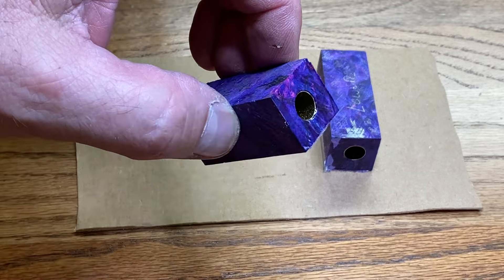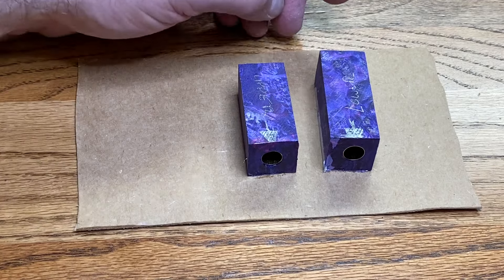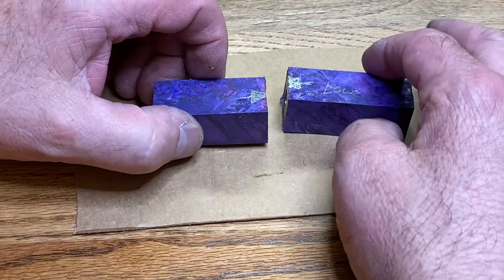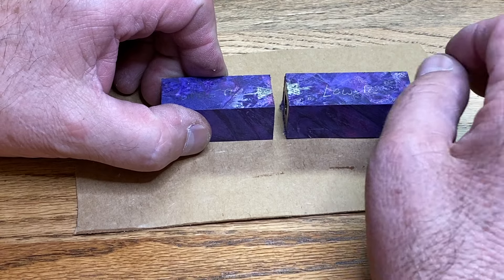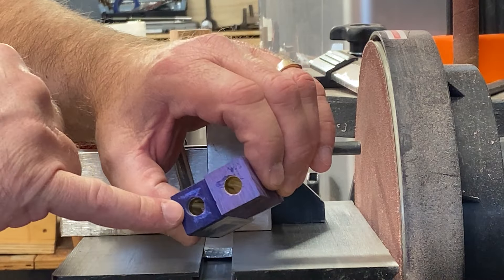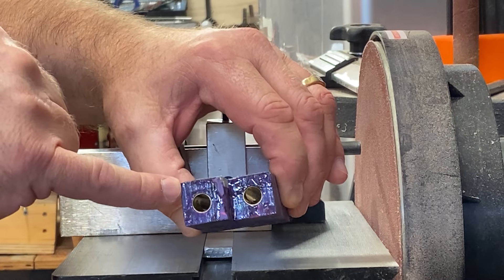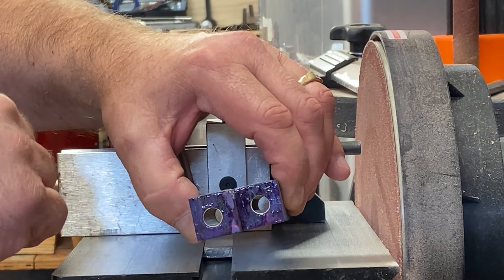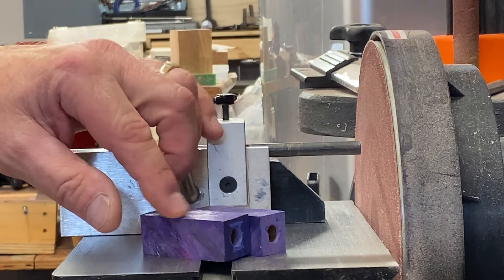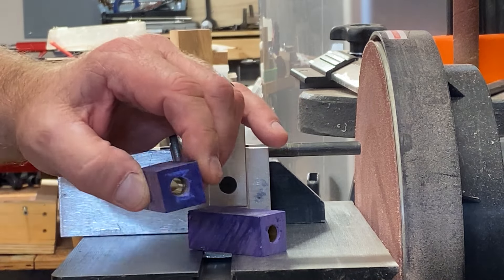I have the tubes glued into my blanks. You can see that they are just a hair below the surface — that's the way we want it because we can take this to the disc sander and lightly touch this end of the blank, which will square it to the tube. If these two pieces meet up on a pin, they're going to meet perfectly. We now need to square our blanks to the tube. There's about an eighth of an inch before you get to the tube on one side. This side will just take a little touching up, and it'll be perfect. The other side will take more work with the sanding disc and sanding jig until we get right down to the tube, and you see that shiny little brass tube right at the face of the blank.